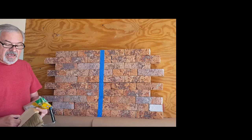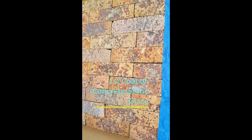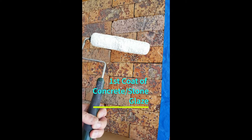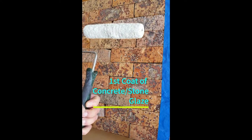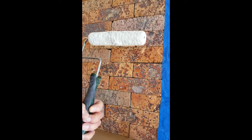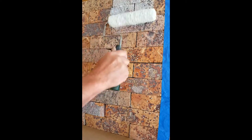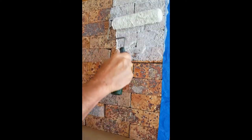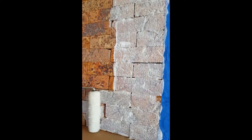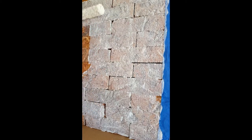This is a woven roller and we will dress it off using the wiper brush. I'm ready for our first coat of the concrete stone glaze. I have my roller and we're going to just roll this material on, pressing hard on the roller to get it to go into the little nooks and crannies, and then wait a couple of minutes for it to dry slightly and then we'll finish it off with the brush. If you have a thick enough nap on your roller, this is easy. If it's too thin, you can't get the material to go. It won't fill in.